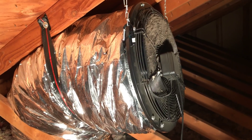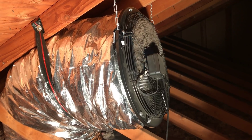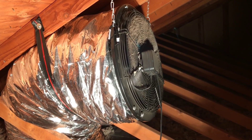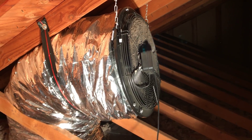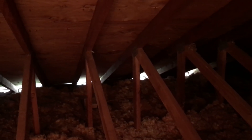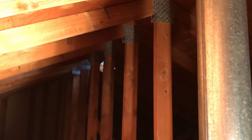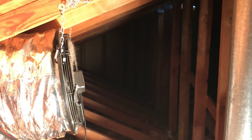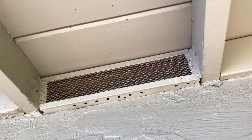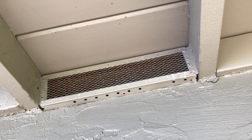You can see it's got some dust, so it's definitely pushing stuff through the house. These are the eave vents — those are all opened up and you want to make sure they're not clogged with paint. There's a peak vent here and another one way over there. You want to make sure it's clear of paint and nothing is blocking it on the other side.